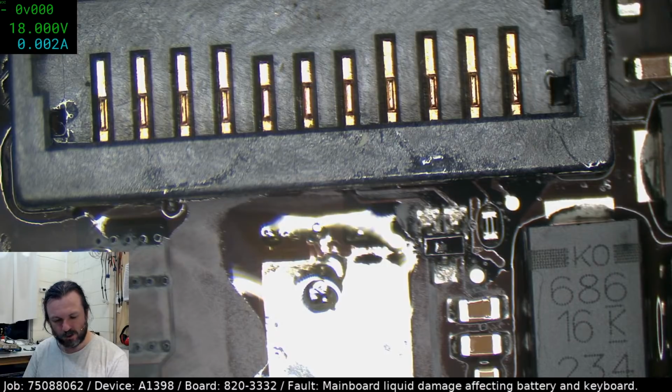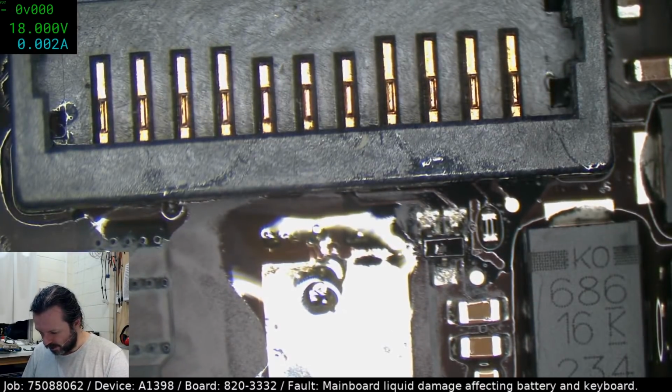One microfarad, 50 volts, 603. That's probably going to be fine. I'll keep looking and see if I've got 25. No harm in going a little bit higher, other than the fact that you will lose a little bit of effective series resistance. One microfarad, 10 volts. 1 microfarad, 50. 6.3, 2.2.